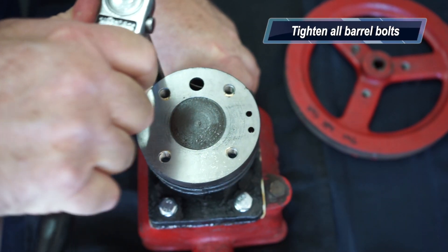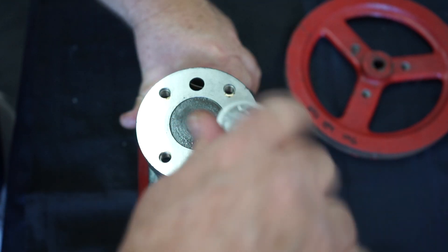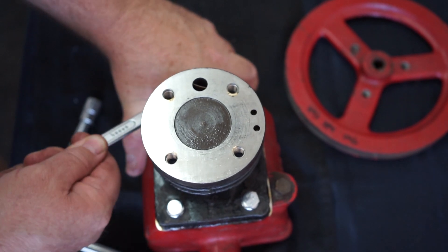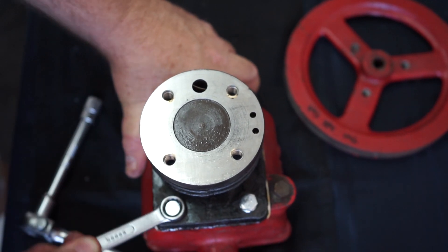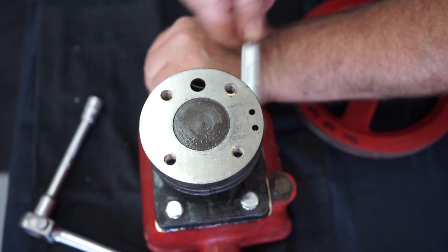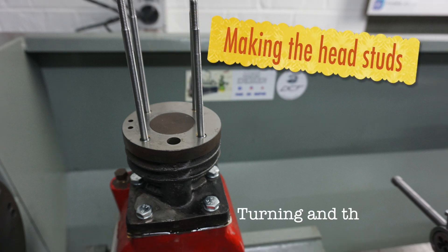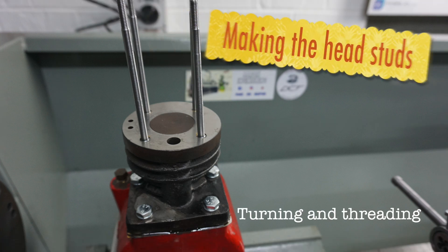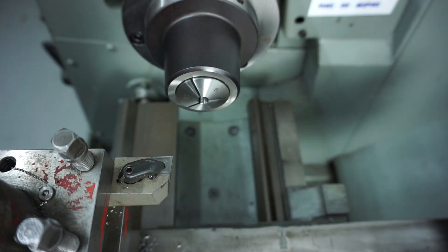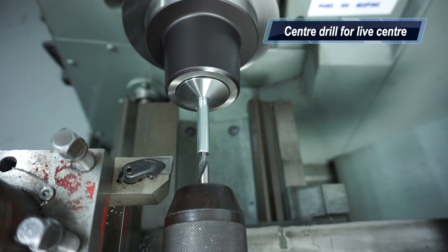Once the barrel slid on I could tighten those bolts up — you can tell I'm an old spinner monkey from way back, you can see me swinging off those bolts. Alright, barrel bolts in, I can now make the rods. These rods will screw in and they need to be an 8mm bottom, then machined down to 6mm and double threaded — so 8mm on one end and 6mm on the other end, metric of course.